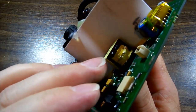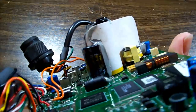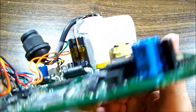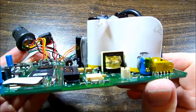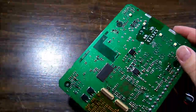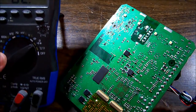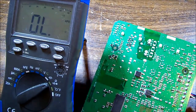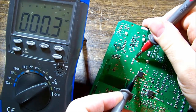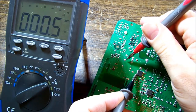We might find if it is connected to there, that is no longer going to be working. It's probably boiled all the varnish off and shorted the turns together. That is not ideal. Bugger. Let's take a measurement there and just see if it's going across to that transformer. It could be end of the game for this one. Oh dear. That's one winding. That's a winding.